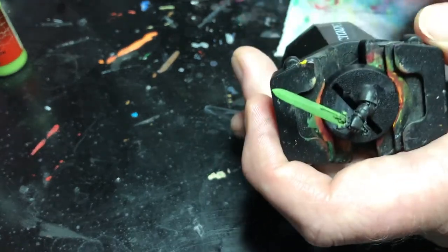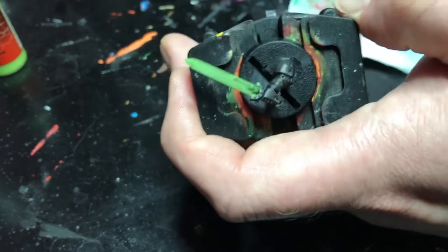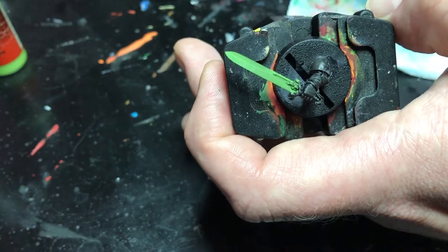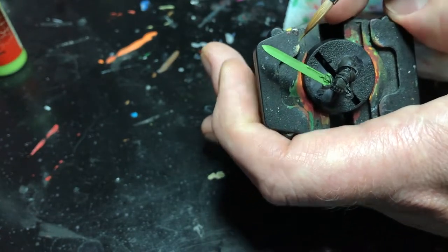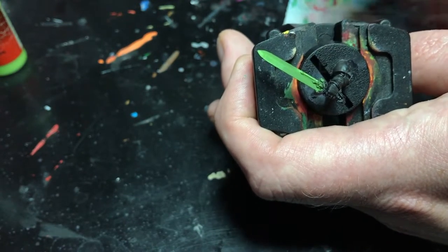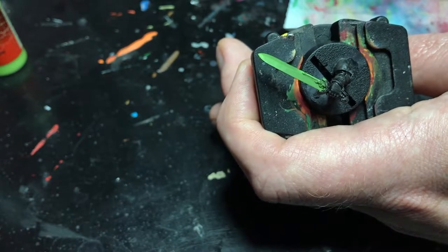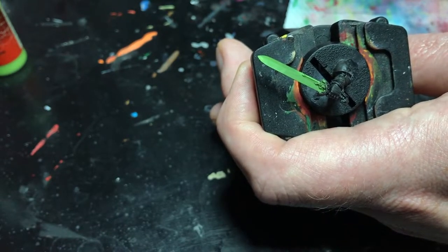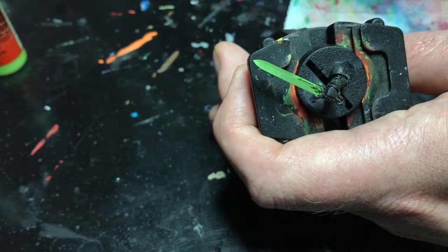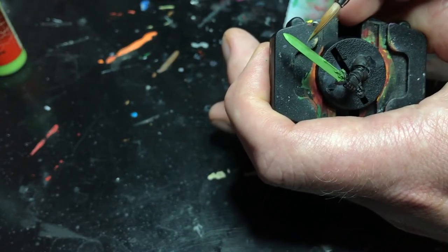The trick is to make sure it's fully dry first, because if you come in while it's still wet, what you'll end up doing is lifting that layer of paint and creating a terrible spot that's hard to deal with. I'm also trying to adjust the camera — I'm trying a different setup here so I can do this painting without my camera being in the way. So I'm going to come back in and get more of this Library Green just to brighten up the color. You can see there's really not much on the brush — that's what you want, just these thin layers, if you want it nice and smooth.